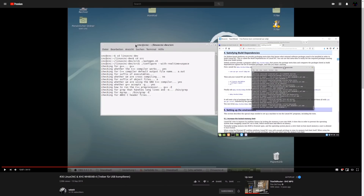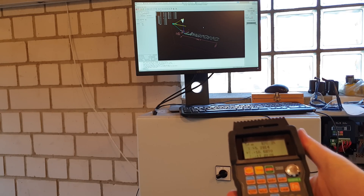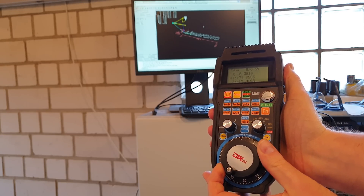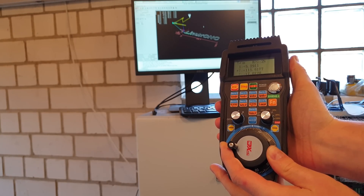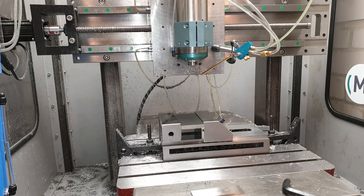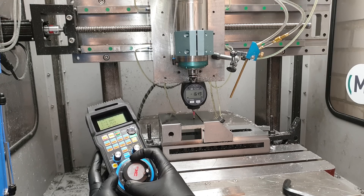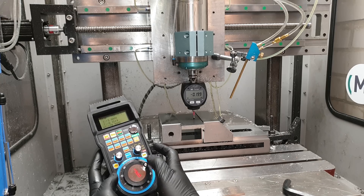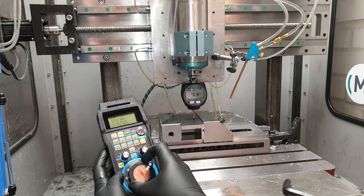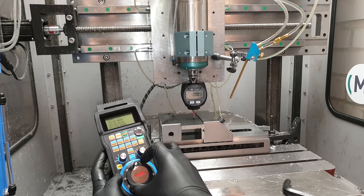The reason why I got it is because there is an almost working driver in the MachineKit project. And thanks to Tala83 on YouTube, it's set up and configured for LinuxCNC in half an hour. This is so nice — whenever touching off in tight spaces, I previously had to try and get as close as possible with a computer keyboard in hand, which usually amounted to being in the middle of the room. I only hope this thing doesn't have a failure mode where it rapid-fires a lot of 10mm movement commands. So far, all good — down to the last micrometer.